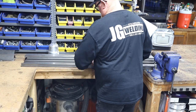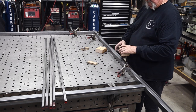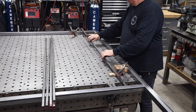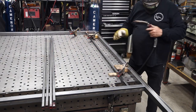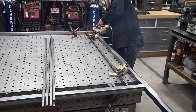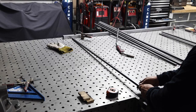I've pre-cut the pickets - these are 5/8" square tube, 063 wall thickness. I pre-cut those ahead of time to save time in the video. I'm placing them in now. You can see I've got my wood spacers here. In California I can't exceed four inches, so these are three and three quarters - well inside - and I've got some shims to get them centered in the panel.